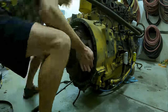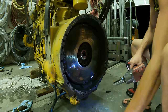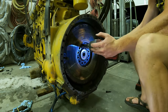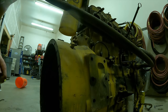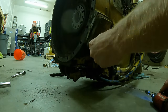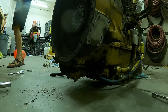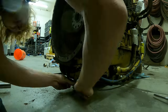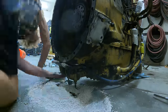Next I'm removing the clutch — it has eight bolts around the perimeter seating it to the flywheel. My engine does have a brake saver unit, used to help slow down the truck as an alternative to jake brakes. It uses engine oil to create resistance. It's bolted between the transmission and the engine with two flywheels — one the clutch rides against and another with teeth the starter engages. Now I'm removing the side plate that feeds oil from the brake saver back to the engine.